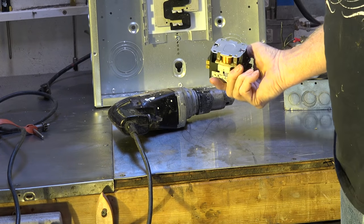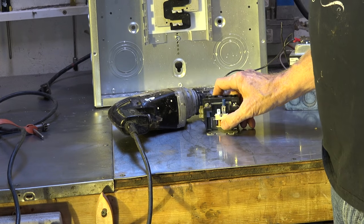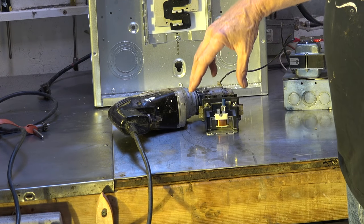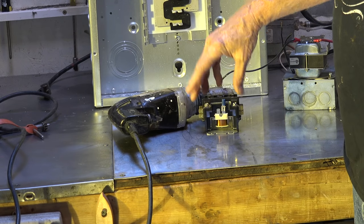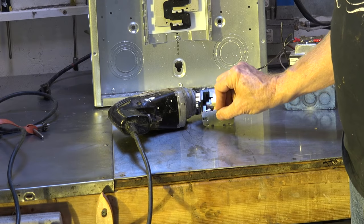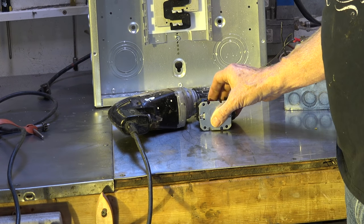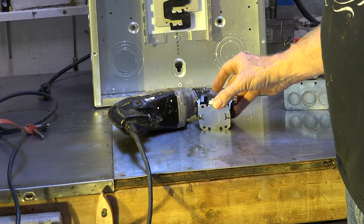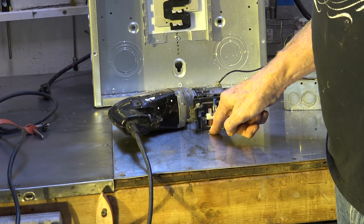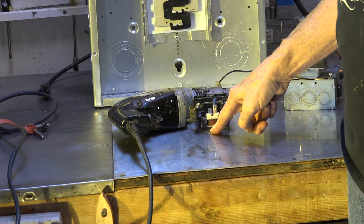There's a part that was probably going to be mounted inside an electrical box. It's metal, and there's power going through it. Power could pass through this bracket — if there was a short fault that energized the metal part, it would go to this piece, which would go to the box itself, which would go back and clear through neutral.